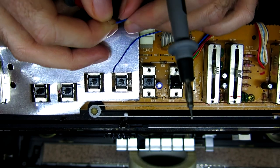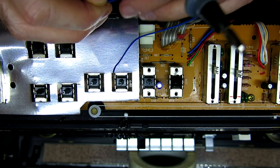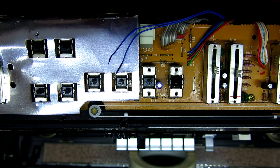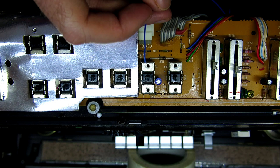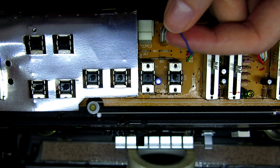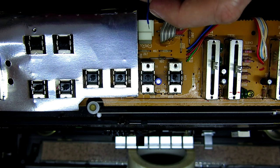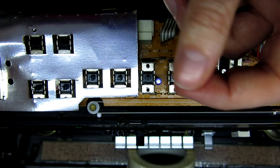There we go — that is ground. I just touched the centre contacts of the speaker, so that side is ground. This bulb has blown. I managed to power this up off the bench power supply and measure the voltage — it was about 10V, a little bit over. So I've ordered some 12V bulbs. That should replace those fine — solder and heat-shrink them on and that should get that sorted.